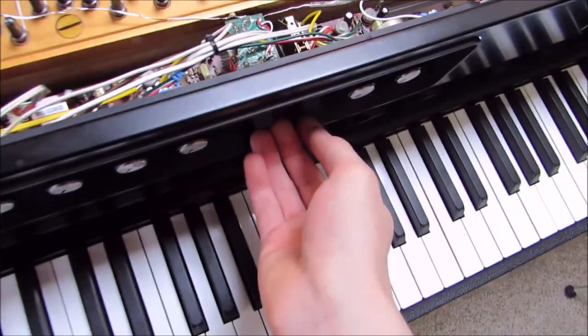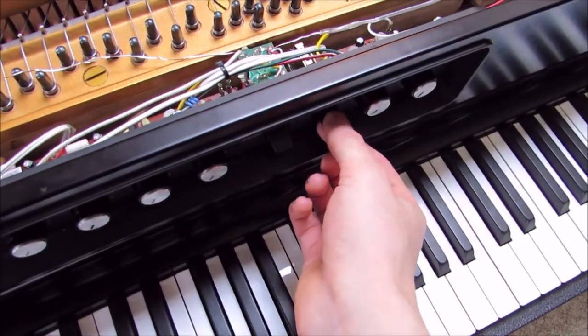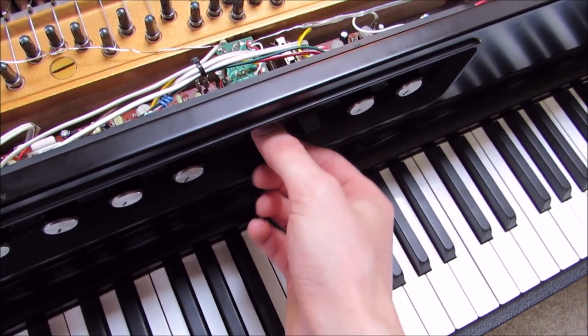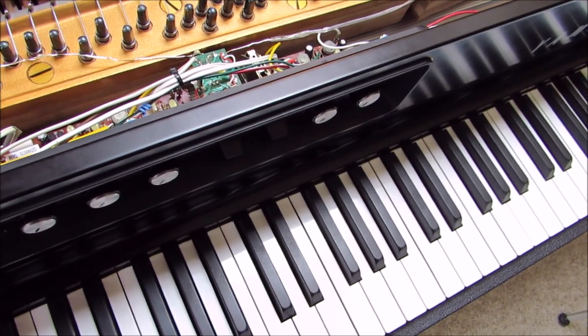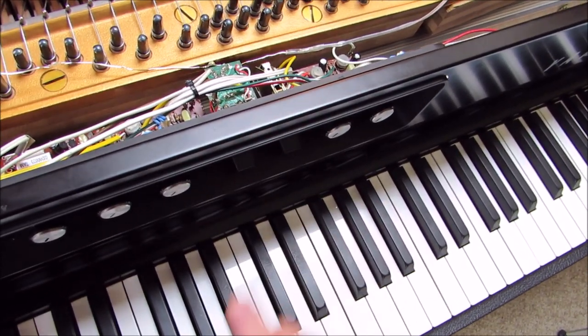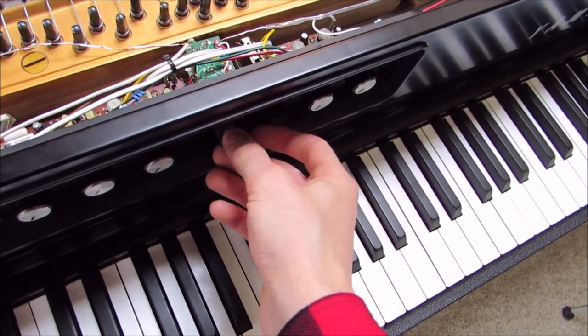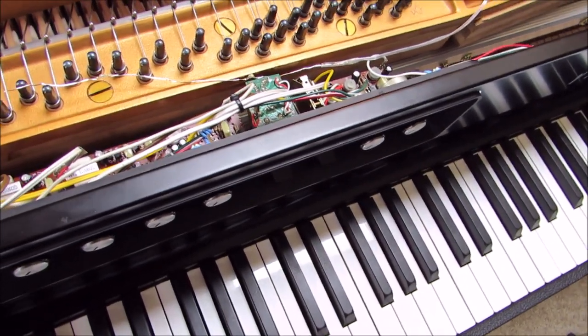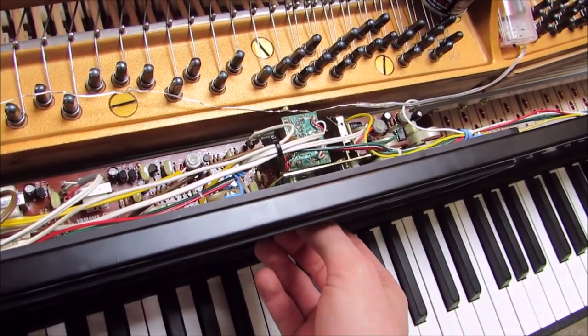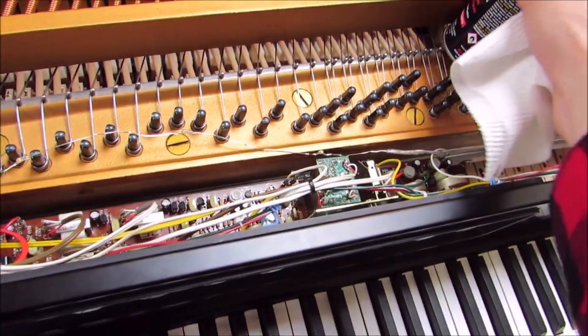And then same thing with the potentiometers. You're just going to flip it up and down, and then you'll wait the 3 minutes, turn it on, check if there's any crackling. If there's not, good job. If there is, just do it again. So it's actually pretty simple how to do this. So I hope that kind of explained how I got mine to sound nice.